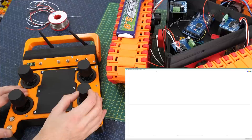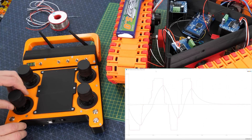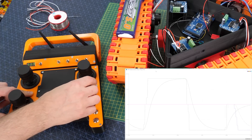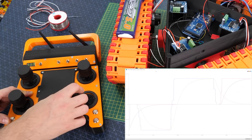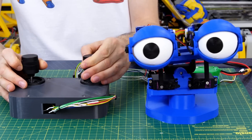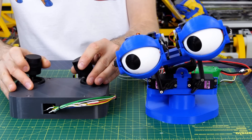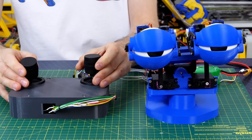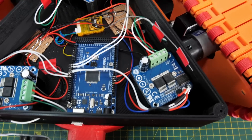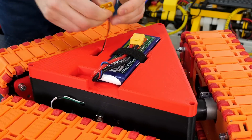We really only need three axes for this project. The Arduino receives the data, and if you check out the video on this remote I made a few weeks ago you'll notice I've also got a smoothed axis for each channel — that's some motion filtering which doesn't let the values change too quickly, giving nice deceleration and smoothing out lumps and bumps. It just takes a large percentage of the previous value and a small percentage of the new value on each code loop so the value can't change too quickly. All the electronics are wired in — PWM pins to the motor drivers, power to the motor drivers, and motors wired into the drivers. On top there's a lid with a recess to put the battery in with a velcro strap to power everything from one battery.